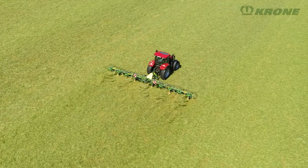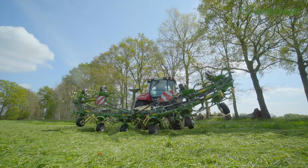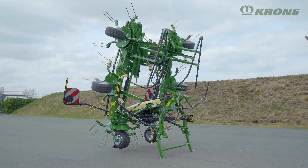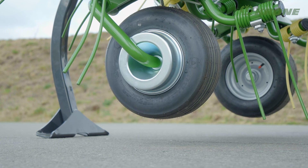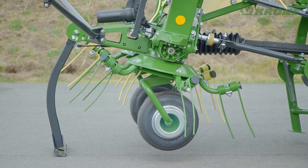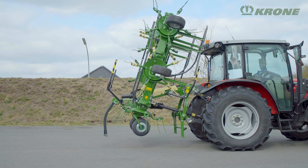Wide in the field and narrow on the road, folding the large machines to a less than three meter transport width is done in a matter of minutes. In storage position, the machine rests cantilevered on stands with the central gauge wheels being suspended. The stand at the rear can be mounted in various positions and offsets the current stroke of the leading damper struts for easy and safe attachment and removal.